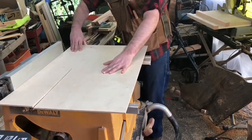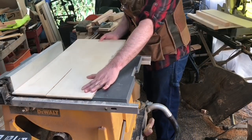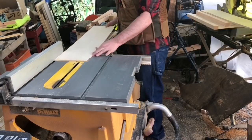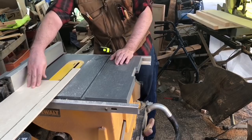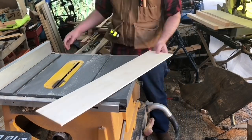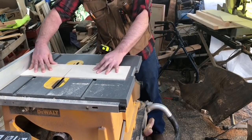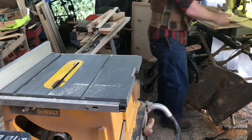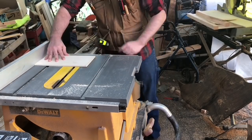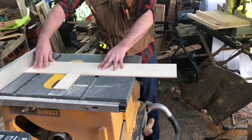In this box we're just going to stick with the plywood. The first thing you need to do is cut your wood to the same size squares or rectangles. You can do this freehand on the scroll saw, but I have a table saw so I use that because it's quick and I like having the rectangles perfectly straight. You could also use a jigsaw or scroll saw — you just need them to be about the same size. In my case they are six by nine inches.